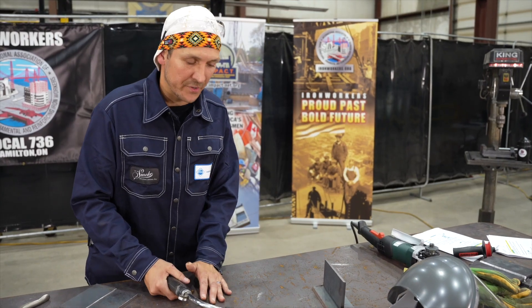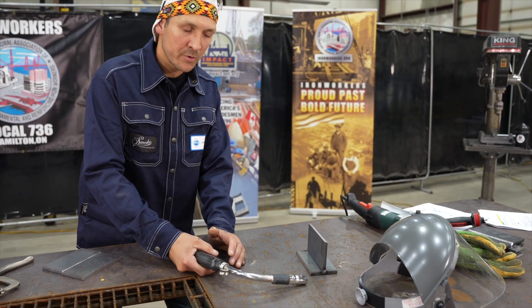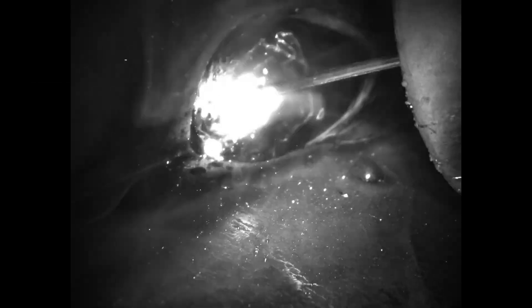Another reason why people fail to make tests is because of improper angle. It's more critical with MIG welding because of that irregular shape of the penetration profile on argon — it's very critical to maintain proper angle while welding.